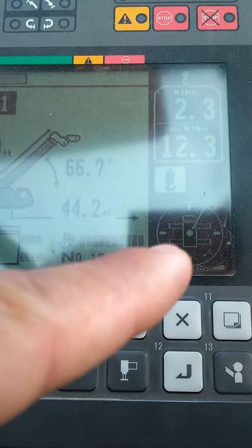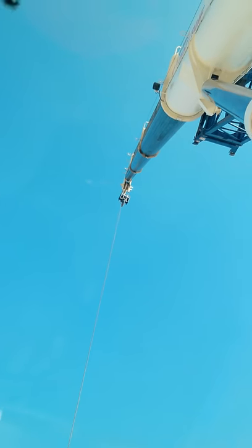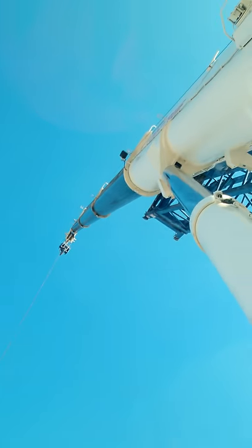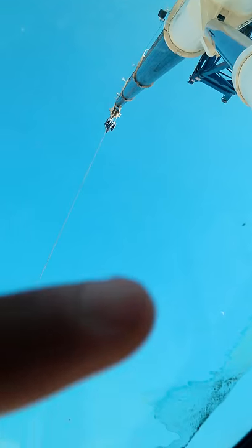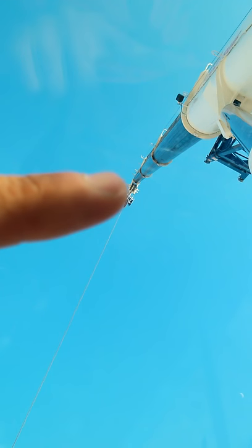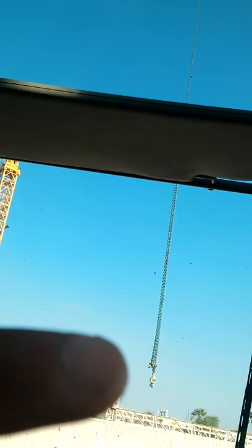This is a diagram basically showing where my boom is at right now — it's at about one o'clock. So my boom is right there: 114 feet of boom, the angle within here is 66 degrees, from the base to the boom tip is 114 feet, and from the whip line hooks back to me is a 44-foot radius.